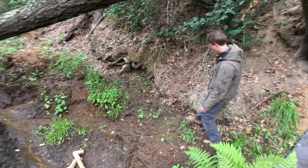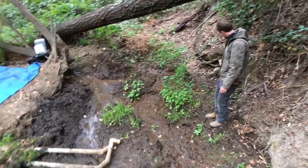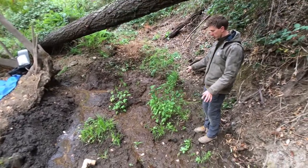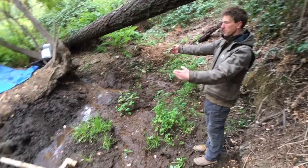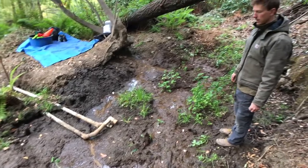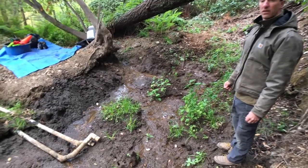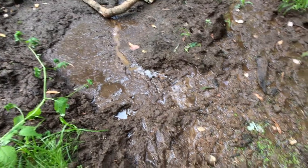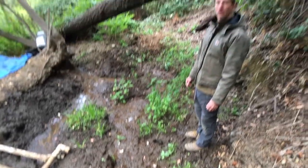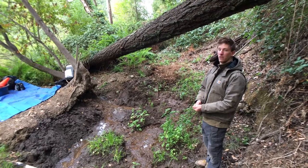We'll be putting in another bamboo rhizome barrier wall. We have a kind of mixed gravel and stone medium and then there's some squishy material. We'll be excavating just a little bit here, then capping and backfilling, with our two collection pipes meeting up right here to go into the existing distribution pipes. We'll be doing another clay sealed bottom and two different stone filtration packages around the collection piping, with some weed mat to make sure the water coming out of the ground is not at risk of any contamination, so they'll hopefully be able to drink straight from the spring.